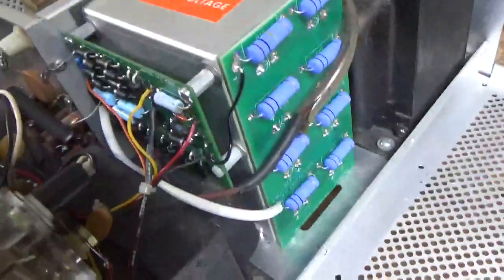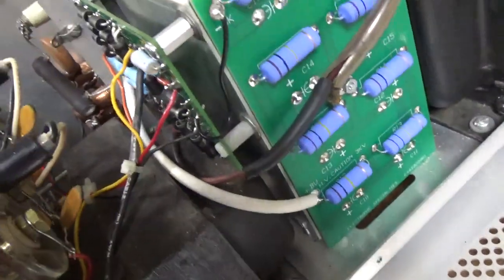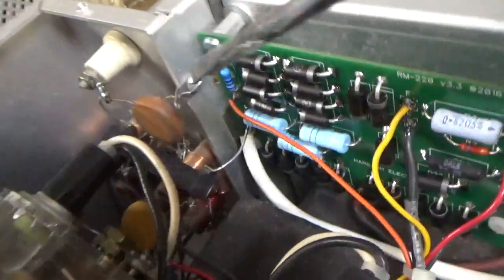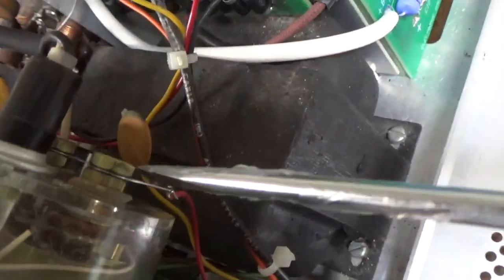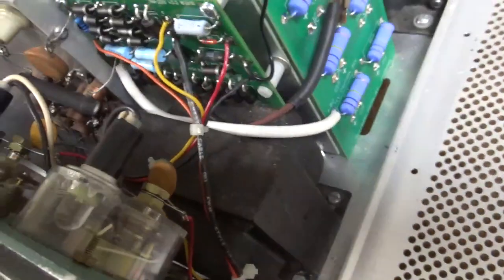Board's back in. I triple-insulated that wire coming off the secondary side of the plate transformer. Got the new B-positive wire here. The wires are re-soldered to the board — soldered both sides, floated the solder through. Got the series glitch resistor over here. Thing's all zip-tied real nice. I always take the outer nut off, then the inner, and snug them up. There's like a fiber washer that's always either broken apart or shrunk over the years — it's all set.